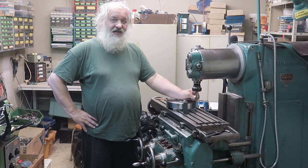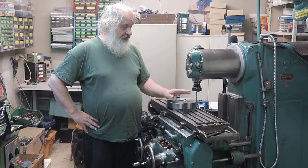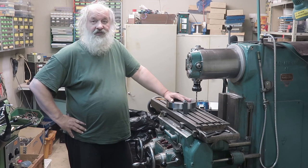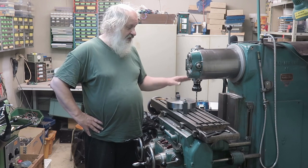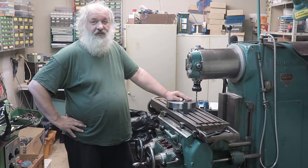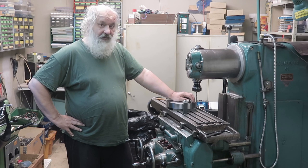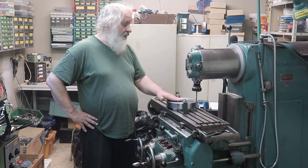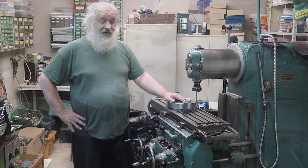This is a 7.9 millimeter drill. I will actually ream the holes to 8 millimeters after I have done the drilling here. But furthermore, I will not drill them all the way through because this material is really tough. And I don't have the faintest idea about the feeds and speeds for this drill with this material. So I just have to. I could very easily break this drill with this operation. I'm going to use the quill because it's very laborious to do the Z-axis in this milling machine. And I will locate the holes by side. So, let's start.